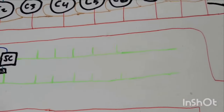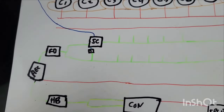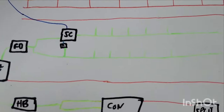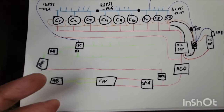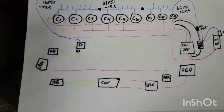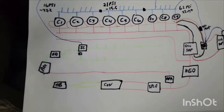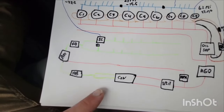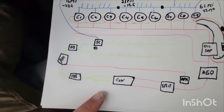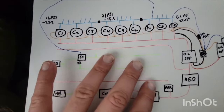This might sound crazy, but I've actually come across a filter dryer with a 30 PSI pressure differential, all right? That very easily could happen. Somebody could have put in an EPR and then you've got some metal flakes in it, just years of neglect. I guess not easily, but it happens. So everything on this side of it was 30 PSI higher, which was causing it to trip on high discharge. So those are all things for high discharge.